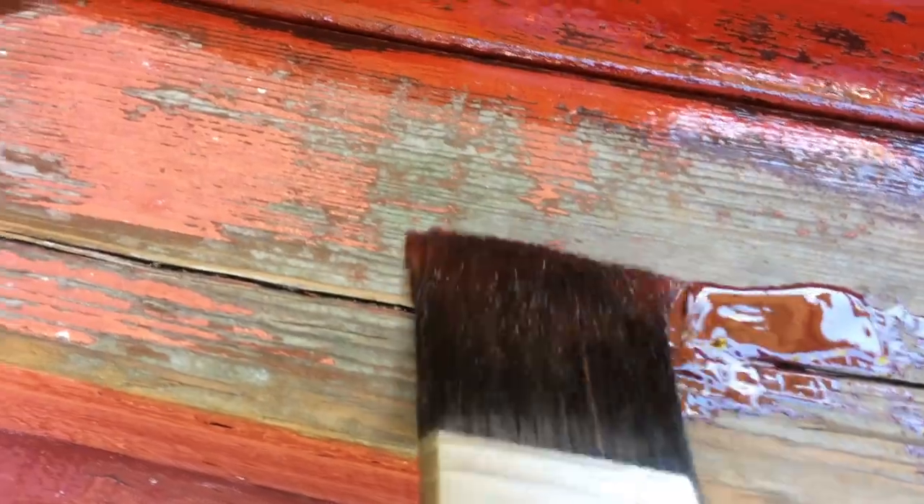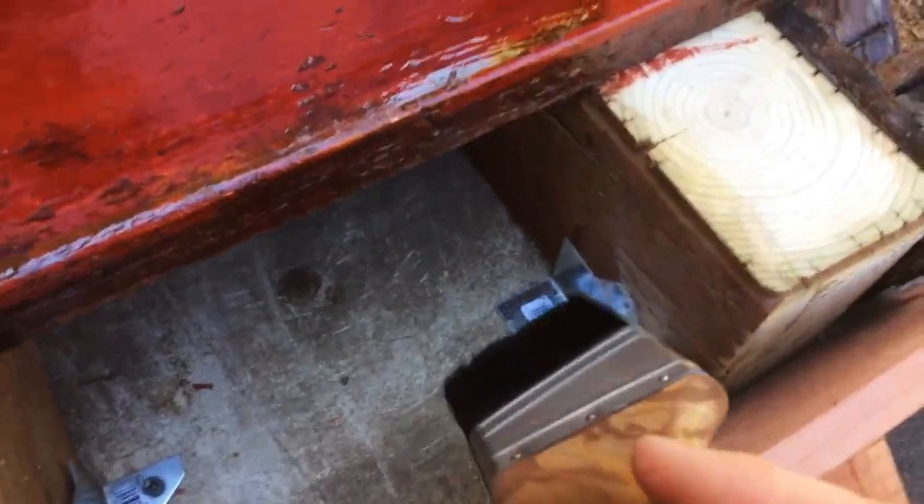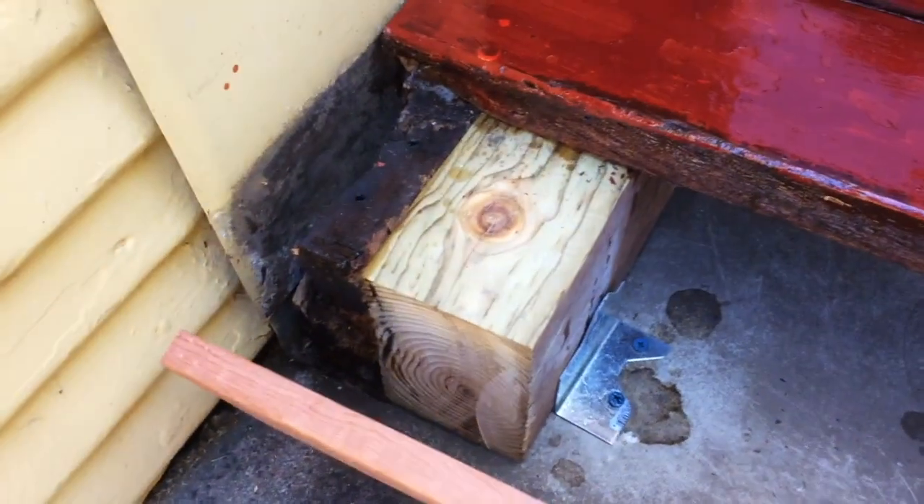This is the first riser I've encountered. Got a pretty good amount of wear right here. I really kind of load it up and sometimes I'll work it in there a bit more. If you notice a little flake of paint coming up, even if it's wet, come in there and take it off. Getting over to where we have the new tread — I'm actually going to take this off so I can coat this edge and that edge. I added these 4x6s, sort of sistered them up, in the process of bolting these to the slab. All the underlayment where I can get to it, I'm going to coat that with a sealer too. That's part of this job — not really part of the Cabot Gold, which is what this video is about.